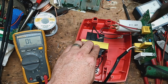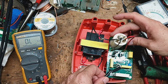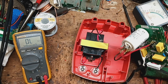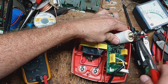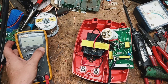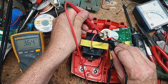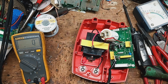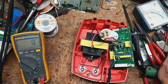Let's pull this board out next — that goes for any electric fence box, old style or new style. Let's check the capacitor size. I think this is a seven and a half microfarad. We're going to unplug one wire to take it out of circuit and put a meter on capacitance. It's reading 3.7 roughly, so that capacitor is pretty weak. But it's probably original in a 12-year-old capacitor — they don't last forever. We'll put another one in there, no big deal.